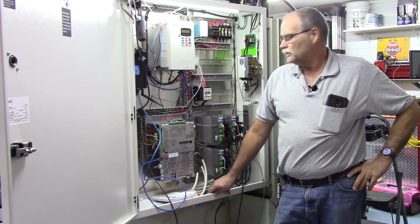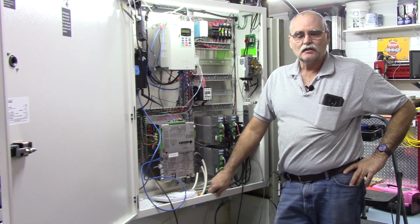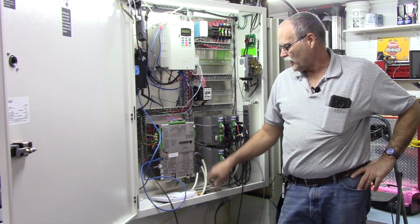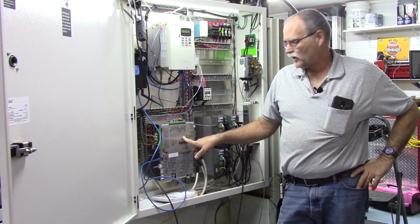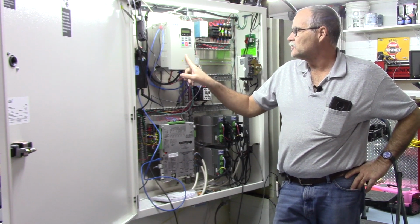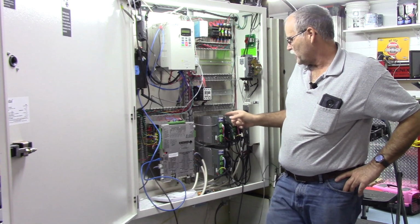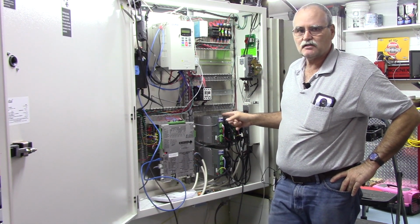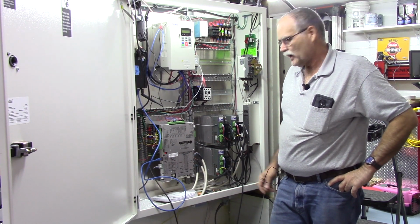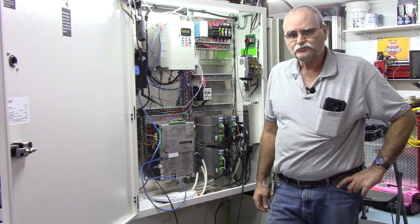I had this back panel on the bench running the DMM AC servos. Just to recap, I'm running Centroid Oak. I'm using the GS3 DuraPulse VFD from automationdirect.com, and I'm using DMM Technologies DYN4 AC servo drives, and they're 1.3 kilowatt NEMA 42 AC servos.